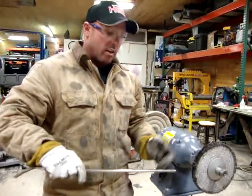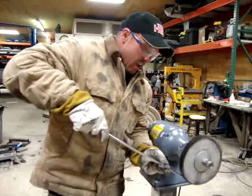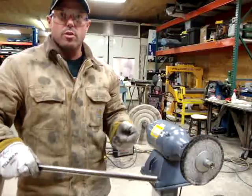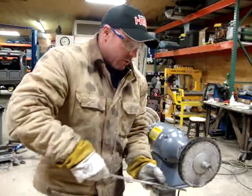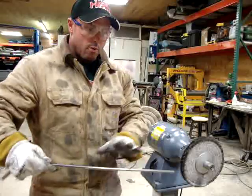There are two methods when you polish. You can polish with the wheel — as the wheel is spinning this way, I can go with it, and that's going to be a little bit of a smoother finish. Or I can pull against it, which is going to make more of a cutting effect. So I'm going to start with this wheel because I want to be aggressive.